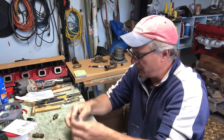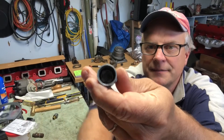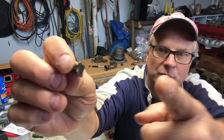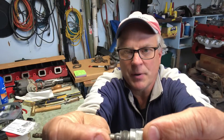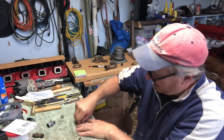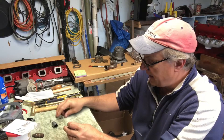The spring goes first into the large portion, and then this piece goes pointy-end down, right in the center of the spring, so it'll end up looking like that. They thread together. What I found was on the end of this piece there's lots of buildup of grease and grime, so it wasn't seating softly or firmly or securely against the other part. That's how it stops air from passing through. Because I had so much gunk, I was cleaning that edge and that edge, blowing all the dirt out.